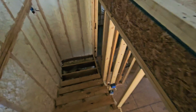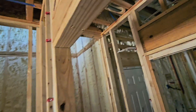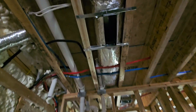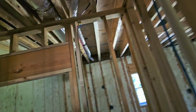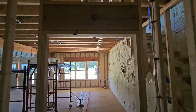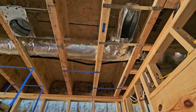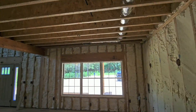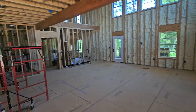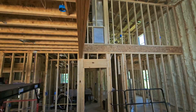Let's go downstairs. Not finished with the build yet — used open cell foam. Now downstairs, you can see there are some lines that come down out of that closet area. There's one line that goes over here, and you can see there's one vent — that's nine — and another vent for this bathroom, that's ten. And then if we come back over this way, we've got two more vents, that's eleven and twelve. That equals a total of 1200 CFM. And there's our 20 by 30 return grill.